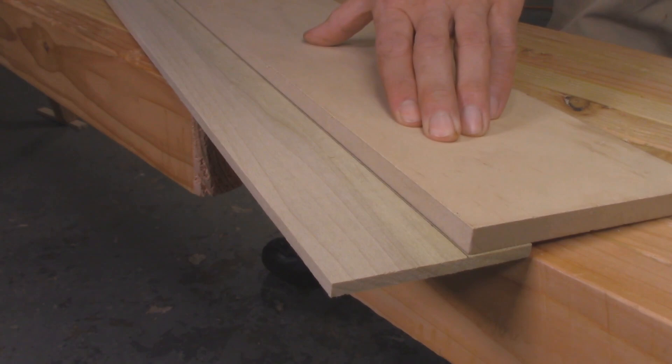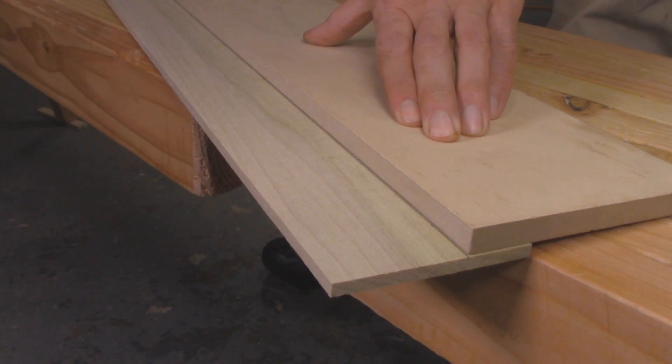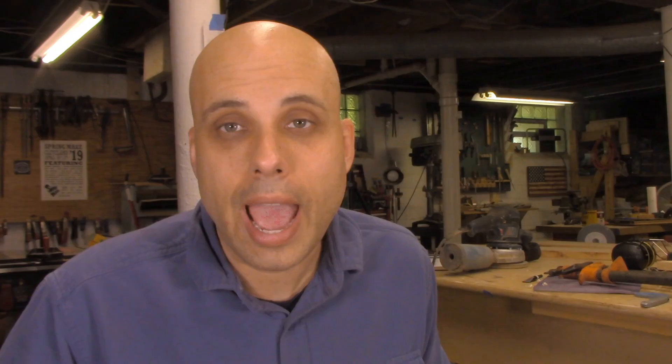To make our super easy tri-square, we're just going to cut four components and laminate them together. Three out of these four components are the same width, so I'm going to lay out one long rip on my board by marking out the dimensions with my tape measure, connecting the marks together with a piece of scrap, and then ripping down that line. This project has enough measurements and details that I came up with a set of plans — they're available on my website, very inexpensive, and you can click the link in the description.